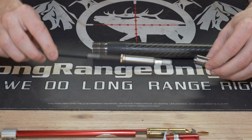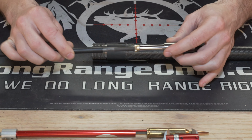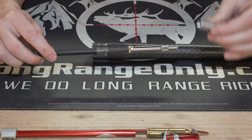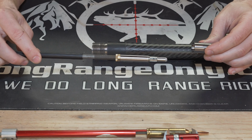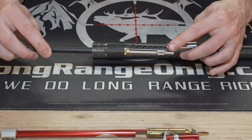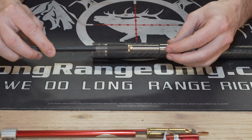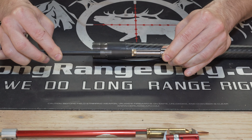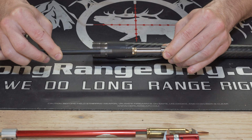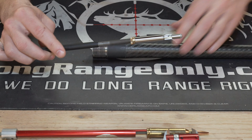And what we're going to do is we're going to stick it into the barrel. So just to kind of give you an idea how that's going to look in the actual barrel itself, not inside the rifle cartridge chamber portion, we can kind of see here. Again, this is a 30 cal, this is a 7. I'm just giving you a demonstration here. This is going to fit a lot tighter, so that's going to slide into the bore of the rifle, and then this is going to center itself on the chamber. So this is what you should get. It should be fairly stable. Again, if it's the right caliber, it will be more stable than this. So that's just showing you what it's going to look like inside of this barrel. So I'll set that to the side.